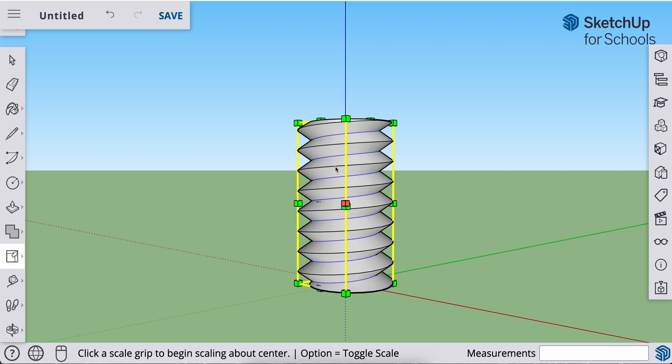Now that we've made this, we're going to move it out of the way and lift it up a little bit, because we need to taper the bottom edge of the bolt. If we were to try and take a nut and put that on there, there's a little too much material on the bottom and it wouldn't start easy — I don't think it'd probably work at all. So we need to taper that in so that when we put that nut on the bolt, it'll thread in there easily. So let's do that.